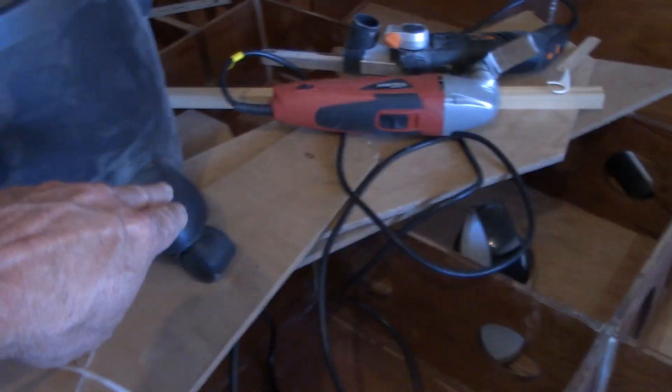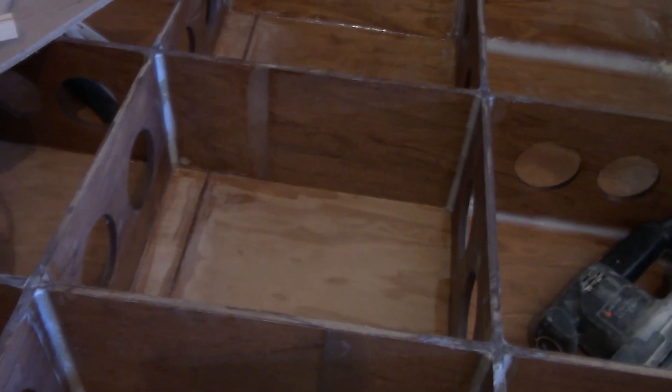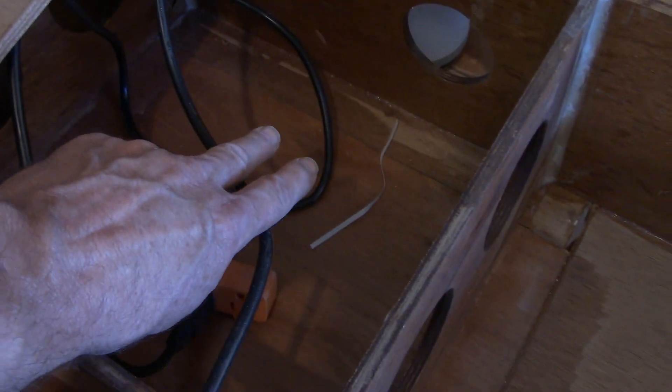The challenge here is that this is where the two halves of the boat — the front and back — are spliced together. As you may recall, this is not one big long sheet of plywood. I had to splice two sheets of plywood together end to end in order to have a piece long enough for my bottom panels and side panels. What you're seeing here is actually the top side of one of those scarf joints — I had a scarf sled set up, put scarf cuts on those sheets of plywood, and bonded them end to end.